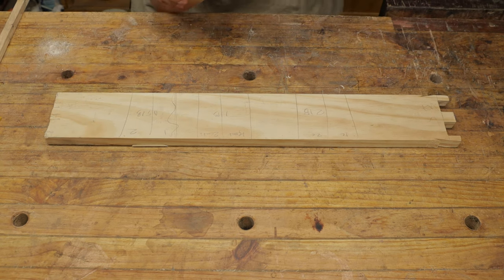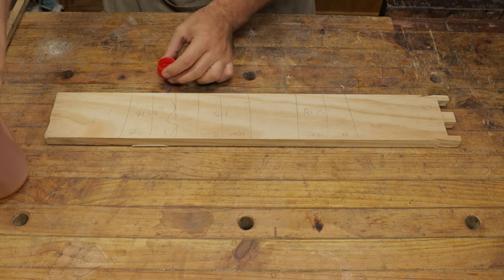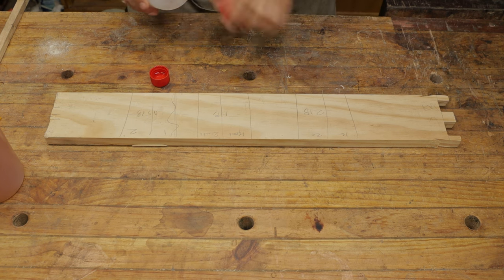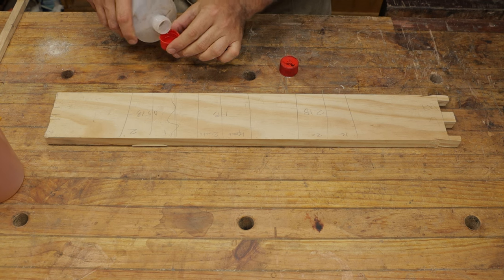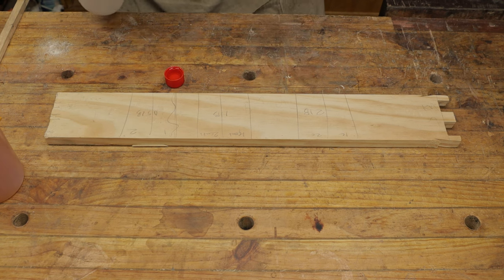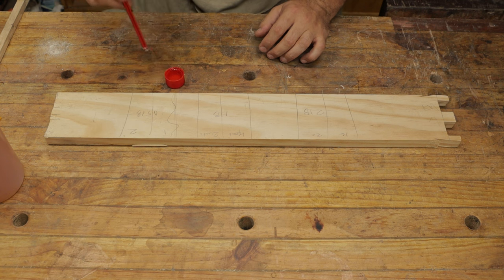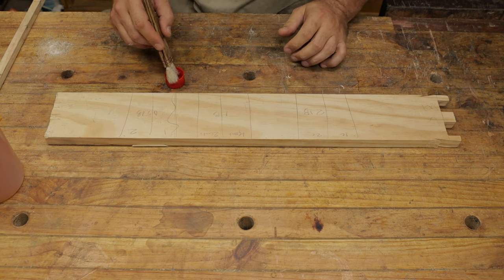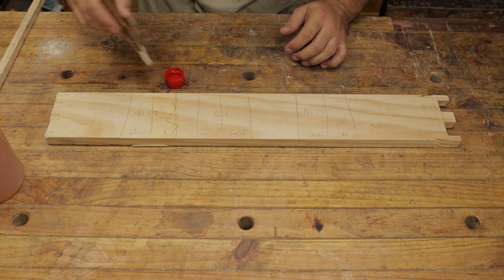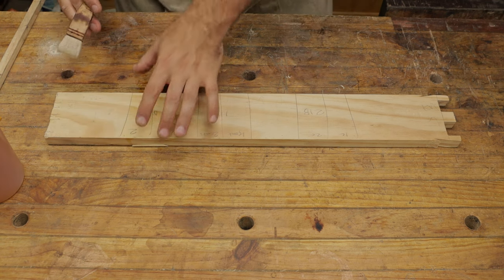To get my half pound, I'm going to pour a little bit of the one pound in here, and then to get that to half a pound we want to double it — so we put the same amount again of alcohol in there. Just give that a quick stir and now we're ready to go. Dip the brush in here — one coat.